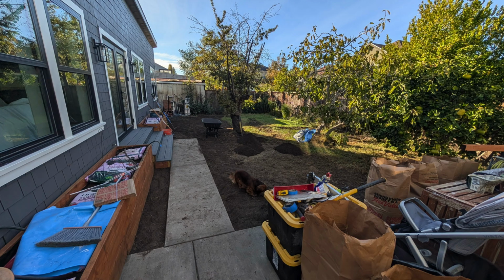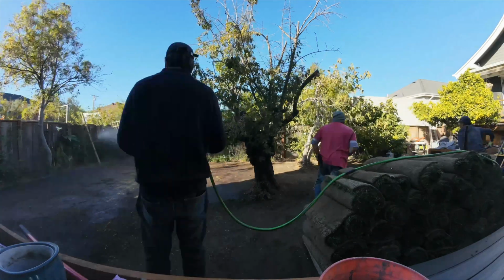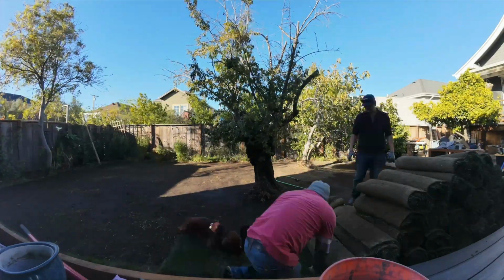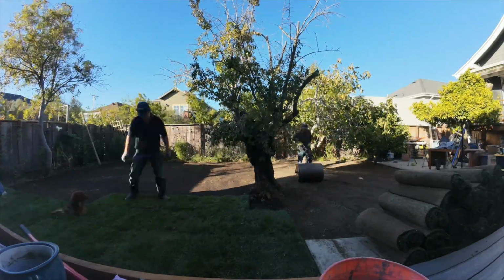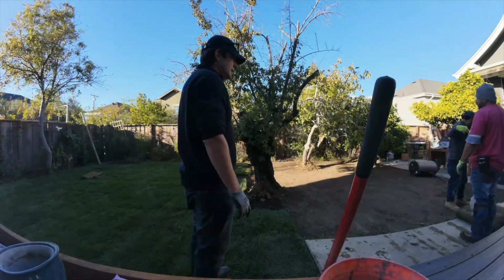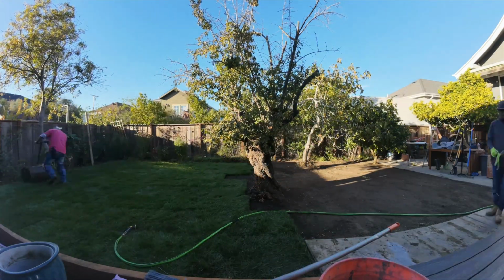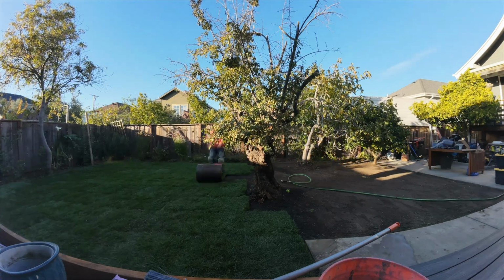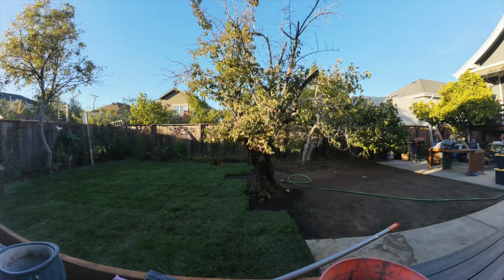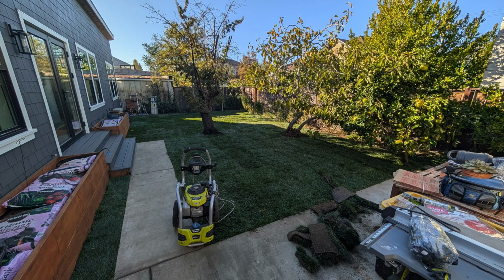So then we were going on some of the landscaping here. We replaced the sod, we took up the old sod, we put some new topsoil down, and here you can see us laying the sod here. This was from Bee Green. Pretty easy. Of course, as with most things, it's all in the preparation, so making sure that the layer underneath is flat and is watered, is relatively aerated, it's not really hard and compacted, and there you can see the end result.